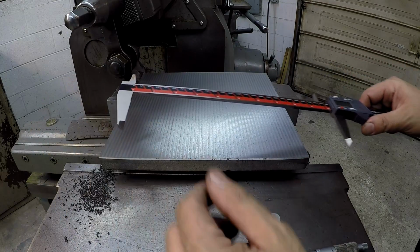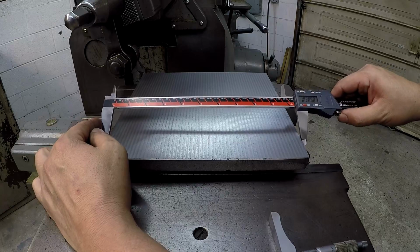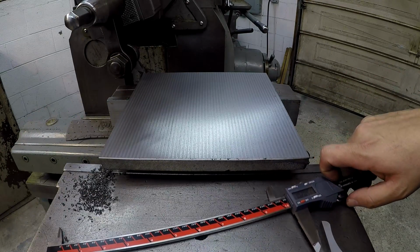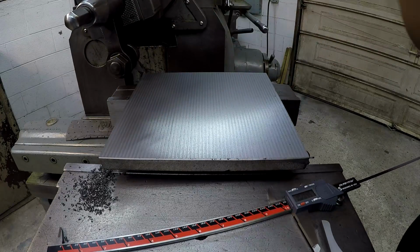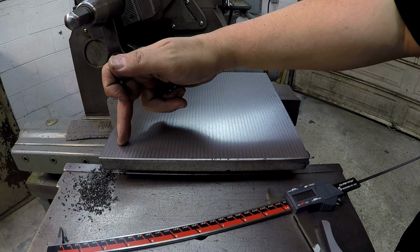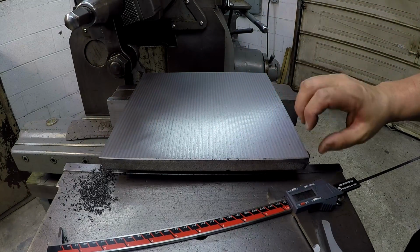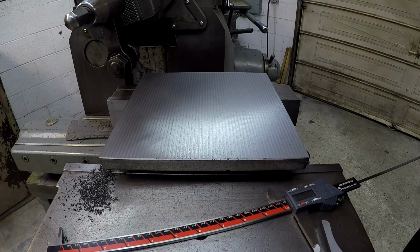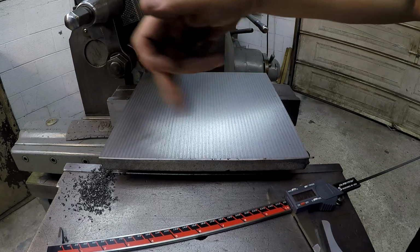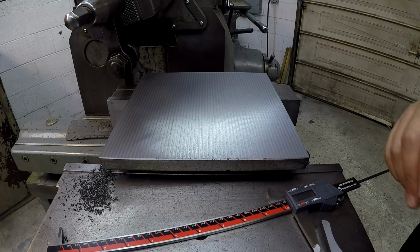I had thought about leaving it like 10 1/4, but since it's cleaning up under that, and I don't want to make it some oddball size. The bolt spacing is designed to be at 2 inch centers across this thing, so you'll come in 1 inch, and then 2, 4, 6, and 8. If I left it like it is, you're going to have a little bit more distance between the edge of the plate and the first bolt pattern all the way around the perimeter. So I've decided I'm going to go ahead and just make it 10 inches even.